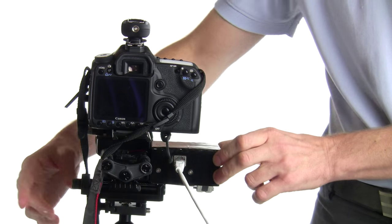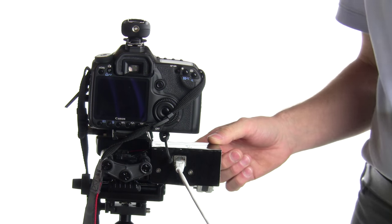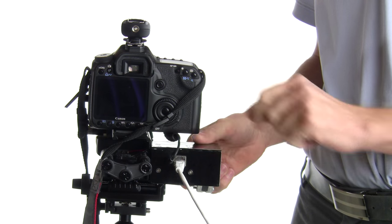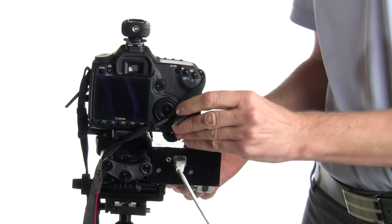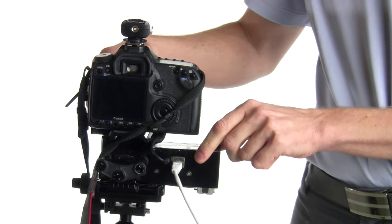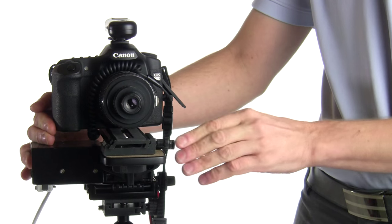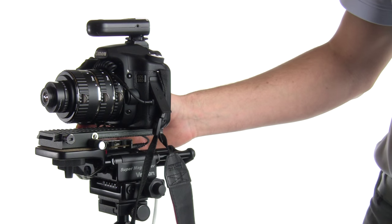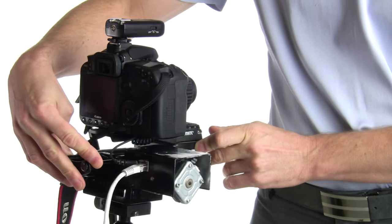There are two connectors. One is a very convenient connector from the Yongnuo range of remote camera triggers — you can buy this cable for many different camera models for around $3. One end has a 2.5mm stereo phone connector that goes inside my motor unit; the other end goes into the camera — in this case a Canon 50D DSLR — to trigger the shutter.